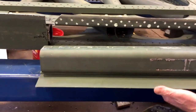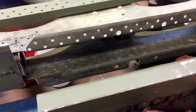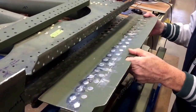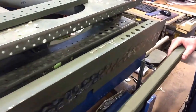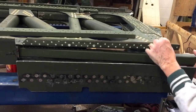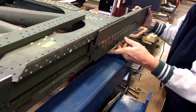So this is the repair part that we have to make. We had to cut the cord back several feet from the end, so this piece of the cord here is brand new. We had to put a new cap on it and rivet that on. And then part of the repair procedure is to put a plug in the inside of the cord, and it goes in this area. And then we put the rest of the cord — the repair cord — on.